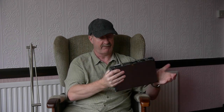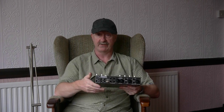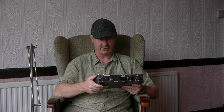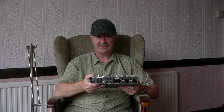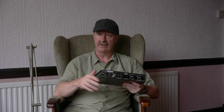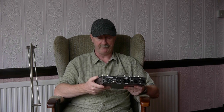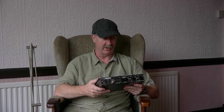Around the back you have a word clock out and two banks of optical connectors in and out. Those can be TOS-link or ADAT, which means you can add an extra 16 channels of mic amps if you're running at lower sample rates. If you're running at 88 or 96kHz, you'd be able to add eight extra channels to your ID44. Audient would love it if you used their rack-mount eight-channel input devices, but I'm sure you could plug anything in — I've got an RME I could plug in quite handily.